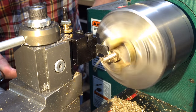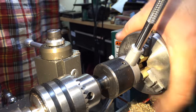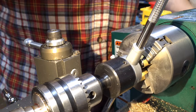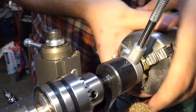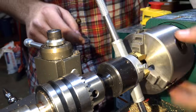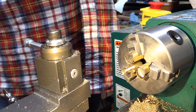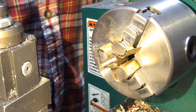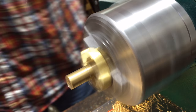Again, the actual threaded portion on this shaft — this shanked area — is shorter than the whole thing. Using a die because I just have one, and on these smaller threads it's generally easier. Brass cuts threads great — it takes no effort at all. A little oil. I'm using a die holder in the tailstock just to follow this hand die holder because one's a round holder and one's a hex holder. That's all there is to that side of the end plug. And it screws right into the body — that's how I'm holding the thing.